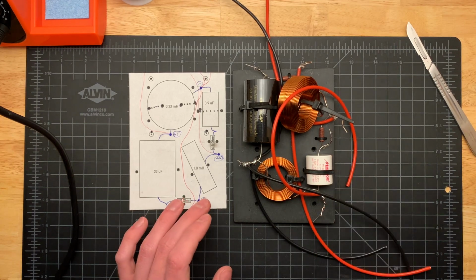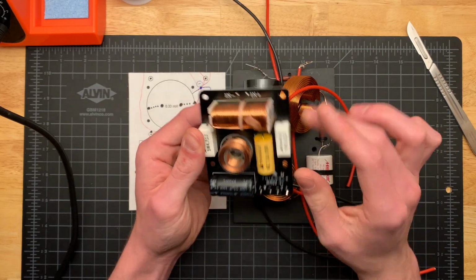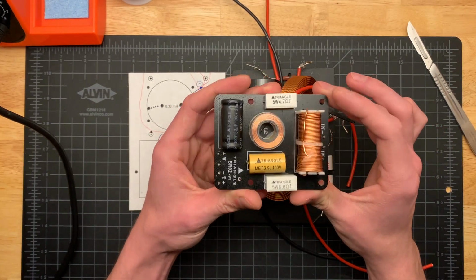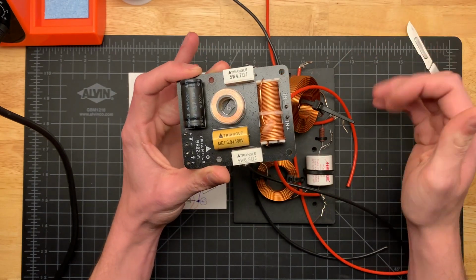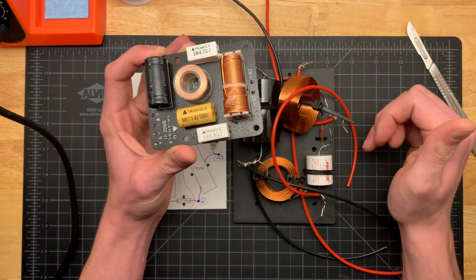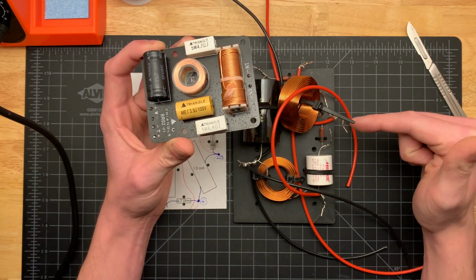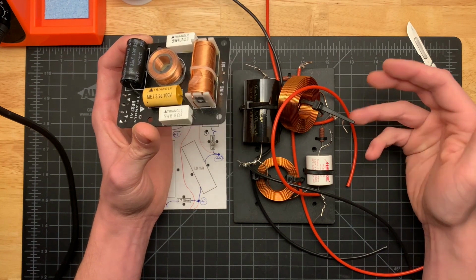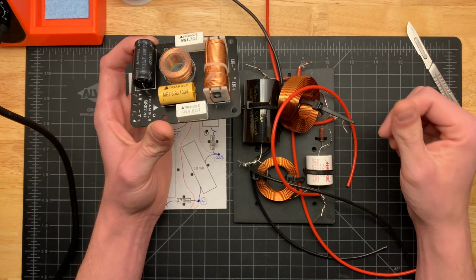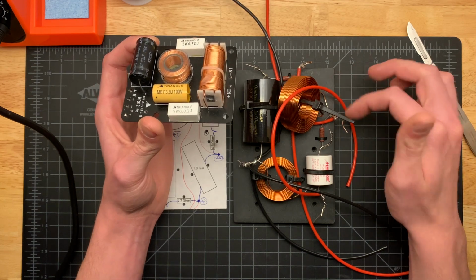And the reason why I went with 5 watts instead of the usual 10 or 12 watt resistors that I've used before is because the ones that Triangle spec'd out are 5 watts. They make me a little nervous being that small, but here's the thing. These parts don't really dissipate all that much energy or heat. They don't really get hot. The drivers are what are doing all the work and what are actually getting pretty warm. So I'm not too concerned about it.